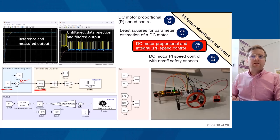So this is absolutely great, because what students can do within Simulink, and also with the control lab and the box on the desk, is visualize signals in real time. They can also make alterations. For example, they can change the reference and see how well the control system performs subject to a change in the reference. They can also tune the PI controller. If they need to make slight tweaks, they can tune that in real time as well. So it's fantastic, because going from theory to simulation where you see signals, now they can see signals in actual real time in a practical application.